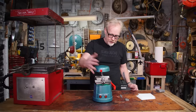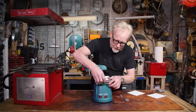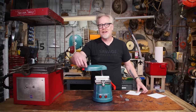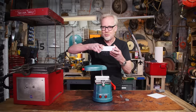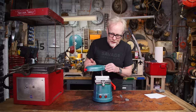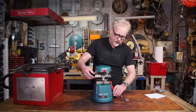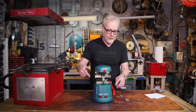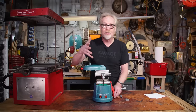Here's how these work. The heating element is in here, the vacuum's down here, and you take a piece of your plastic and clamp it in. This is something I really dig about this machine — it's roughly five by five inches, but you could actually fit a six by six inch piece of styrene in here and it'll work just fine. The element swings in and swings out, which I think is pretty great. The frame holder has two positions: one right close to the heating element, and one about an inch down. I've been finding it works way better an inch down — up here, the heating element is too hot and actually starts to roast the plastic before it gets to the right softness.